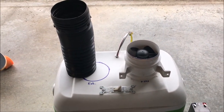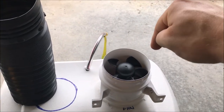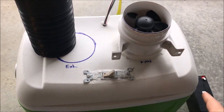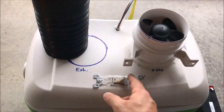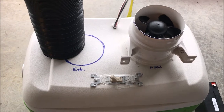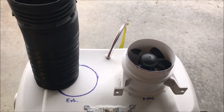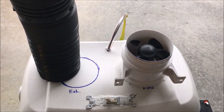I don't know why these aren't in a lot of planes, other than they're just kind of ugly, but they work really well. Basically, it all starts with this fan — it's pushing air down into the cooler. I put a switch on there, just a regular AC switch. Not too worried about the contacts eroding since it's a DC system and there's not a lot of amps being passed through. I got a beefier size switch just in case. It's up to your discretion if you want an actual DC switch, or if you want, you can put a nice beefy potentiometer on there to control the fan speed, because sometimes it actually gets really cold up there, especially when you get some altitude. I'd rather be cool in the cockpit than burning up and having to wipe my face off.